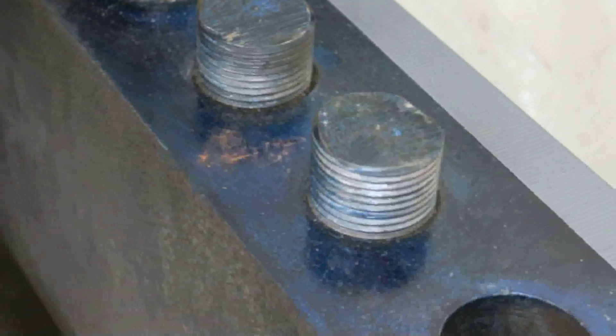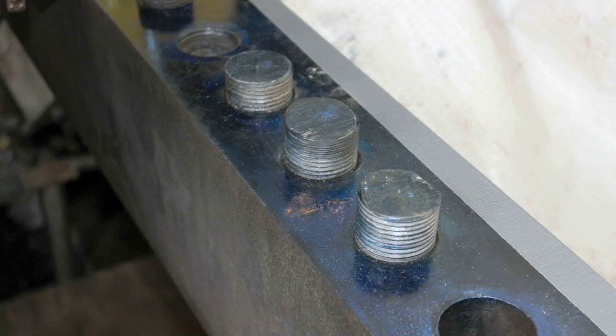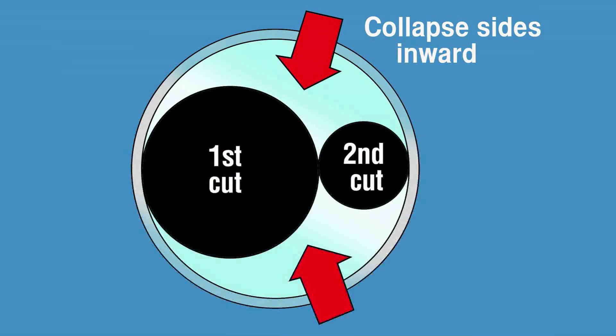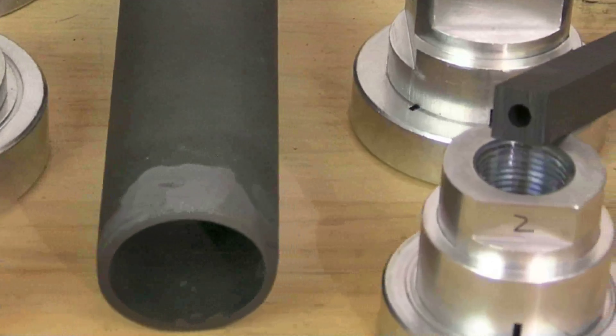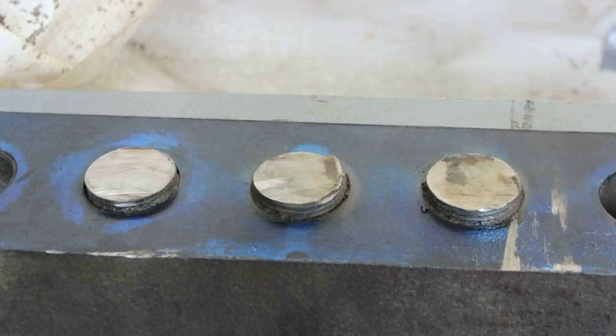Today, the application is a one and three quarter inch stud about three inches deep. We are taking a multiple pass approach with round electrodes. Multiple cuts in a wide range of sizes and shapes, from round to square, can be used to remove the bolt.